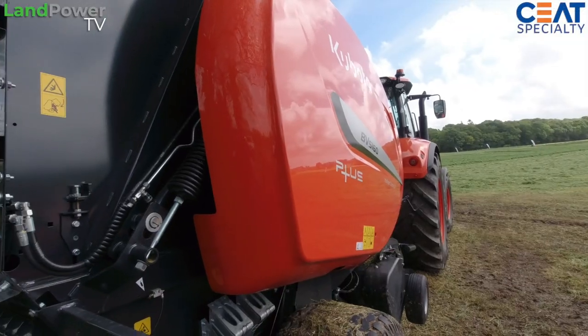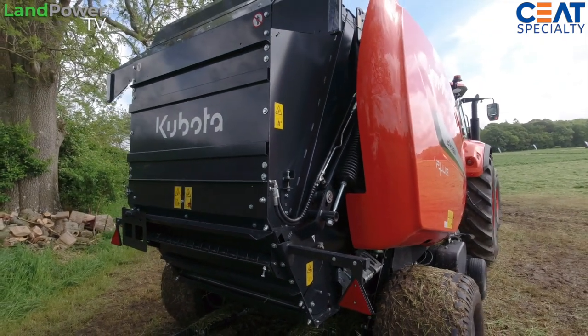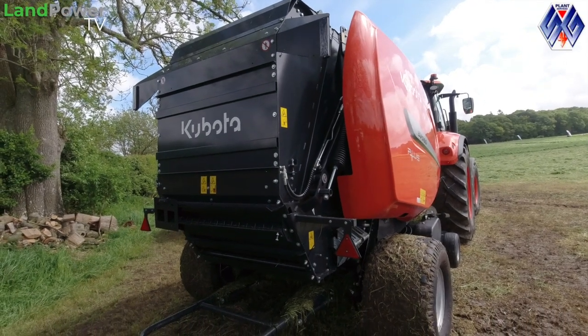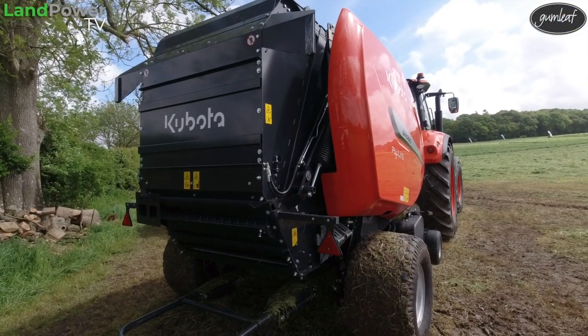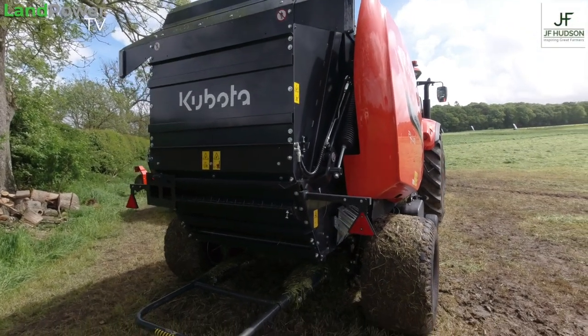They're going to have to come up with a system that reads the swath in front and then relates the speed to that. But yeah, I mean, sensors inside telling you moisture, telling you pressures, sensors on the bale ramp. And yeah, it's just a very nice operation for the driver. None of this foot on the clutch, foot on the brakes, backing up. You literally just let the baler take over the control systems.